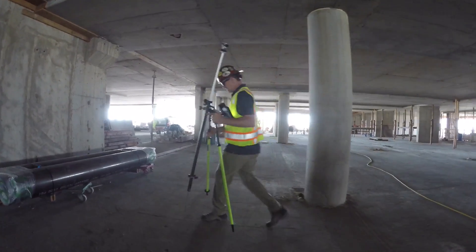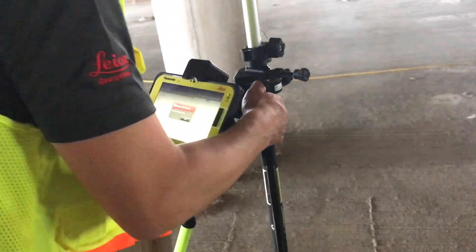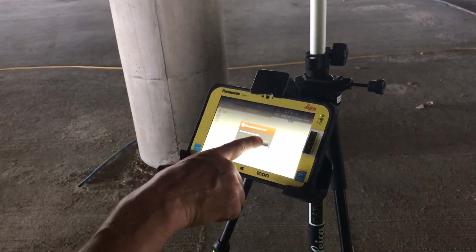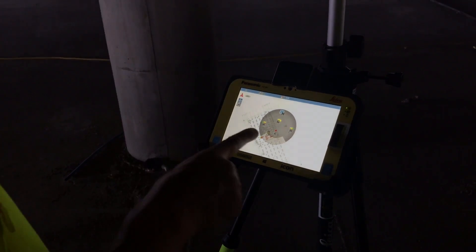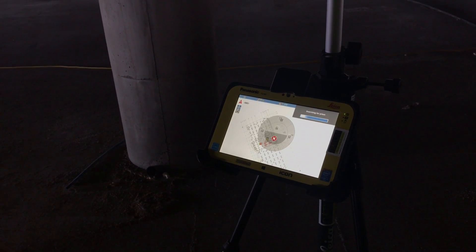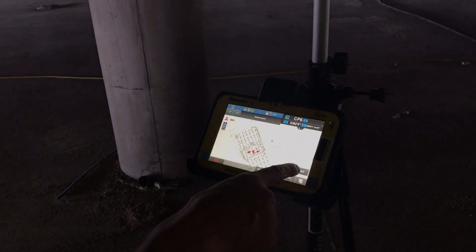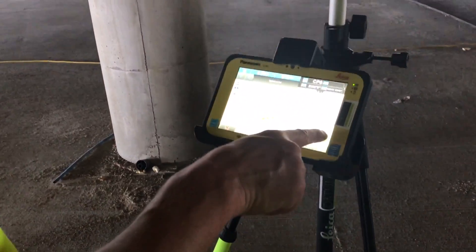That's okay, because we can come over here and find our control point. While I walked over here and got too close to it, the screen says 'measurement not possible' — that's because it was tracking a measurement and then stopped. So we're going to say okay to that and simply tell it to come find us, which is toolbox, move and search. We need it to spin left this time, so we select left, and it's going to spin over and find us. Now after it finds us, we select Start to start measuring. I'll glance at the level bubble and make sure that's good, then hit Store.